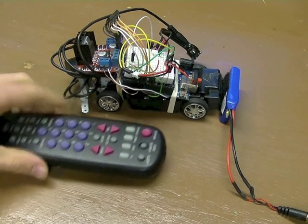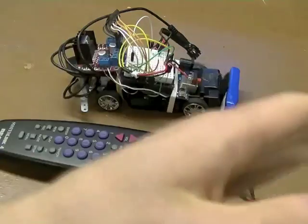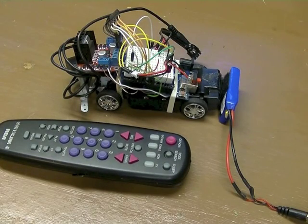I think there's a little amplifier circuit built in here. With the three-pin Radio Shack one, I only got like two feet of range. The code reads the signal — it's just a binary number. I think it's got 13 places of binary numbers, and it converts it into just a regular easy-to-read number, like 140 or 142. And then the Arduino uses switch cases to decide what to do with that number. I have five switch cases: forward, backwards, left, right, and stop.